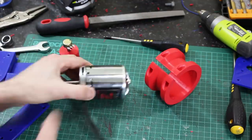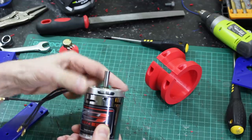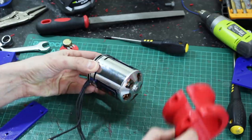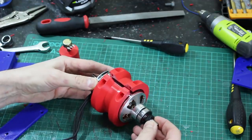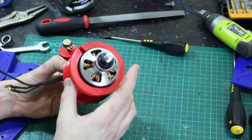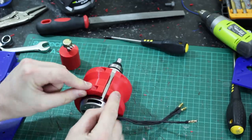Let's talk about the pulley that's going to pull the tendon. We're going to use the body of the motor - it's a brushless motor where the outer body spins and the spindle spins. We're going to put the encoder on there so we can measure the motor position, and then the pulley fits around the motor body. We'll stick another bearing on the back with the extra attachment that comes with the motor. I've left a little gap so we can get some rubber matting in to stop it slipping against the motor body.